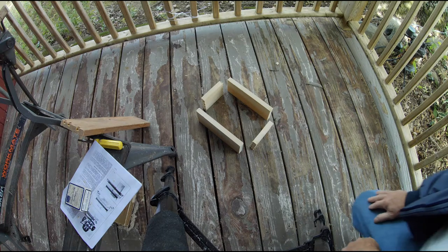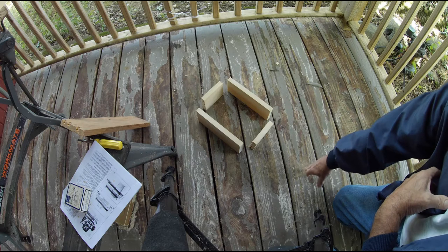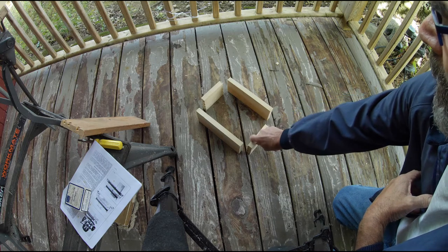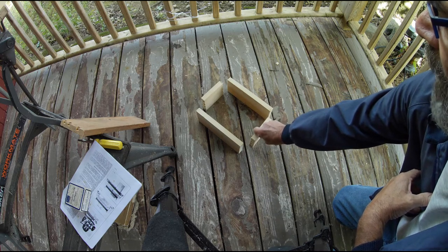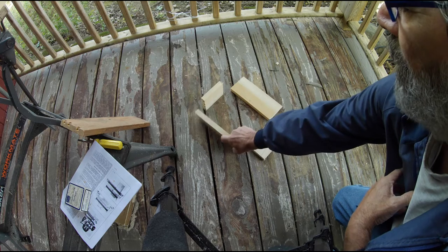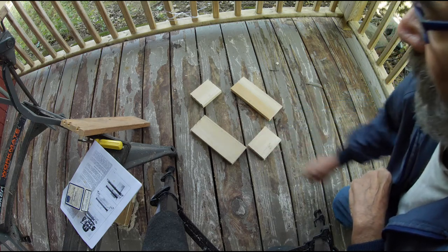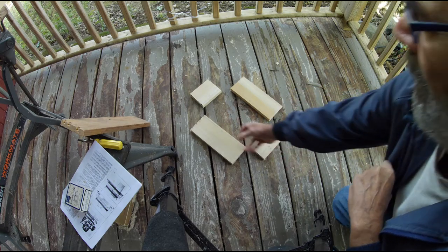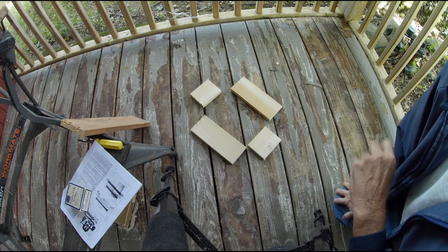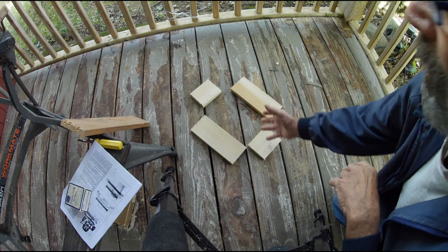What I usually do — because I'm making the cuts on the inside, all the jigs do that — I go with the corners. I'll do this corner and then the front with this side. You have to mark them so you know which one is the bottom. If you already have the groove for your bottom piece, fine. If not, I put a little line. A, B, C, D — it doesn't matter how you name or number them.